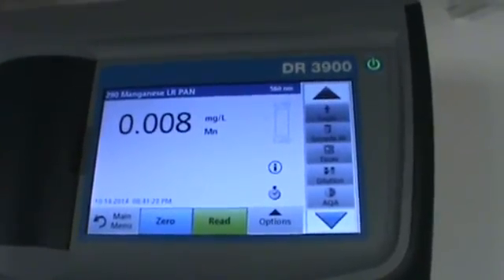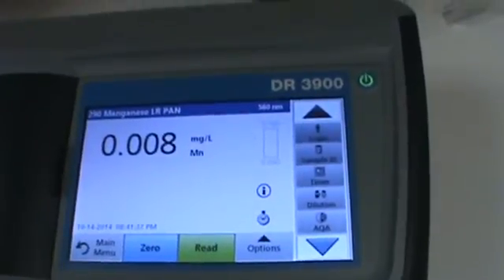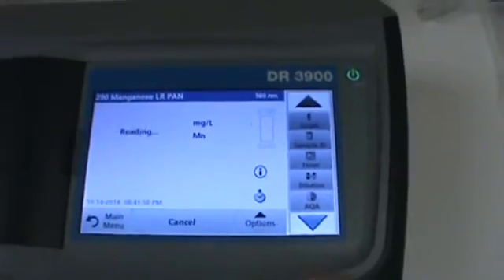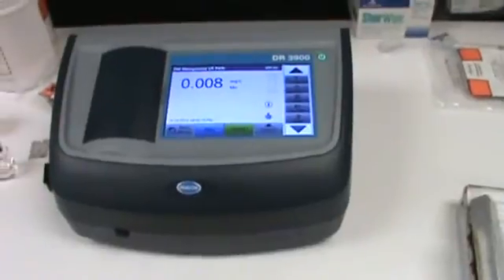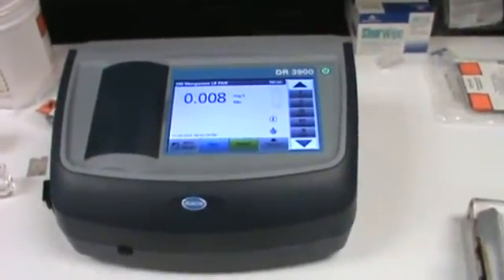So we know from the sedimentation basin that all the soluble was turned to insoluble manganese and it came through the filter. We still have 0.008 — eight thousandths of a milligram per liter of soluble manganese making it through the filters, which is perfectly acceptable. The most important one is what we're sending out to the public — this is our finished from our tank — and it's the same, 0.008. Those are good results considering some of the numbers we've seen in the past when the reservoir turns over; it can get really hard to remove all the manganese. We're happy the reservoir is done turning over so far this year.